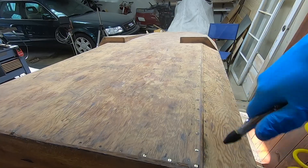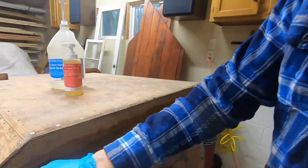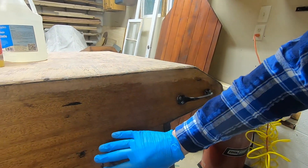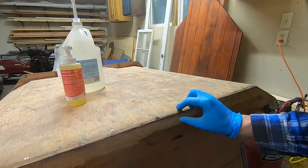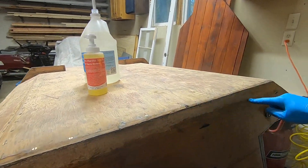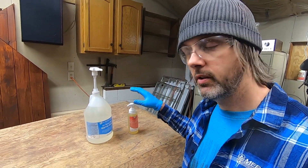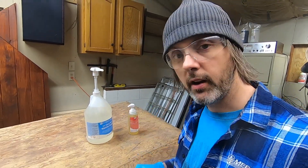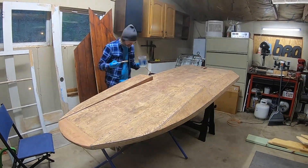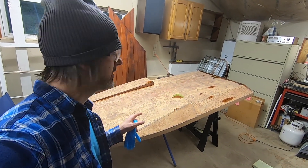First things first — I want to blow off this hull to open up the pores. Before I started the epoxy I did one more thing: I scraped the bottom inch or so of the transom. I think this finish is in really good shape — this varnish looks great. I just wanted to expose this edge or seam of where the wood comes together. I installed the pumps and I'm going to pump until both pumps are primed. It is one squirt to this and one squirt to this — that's a five-to-one ratio — so it should be ready to rock.